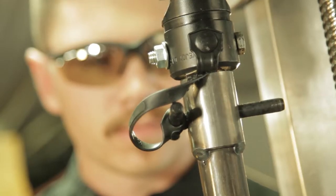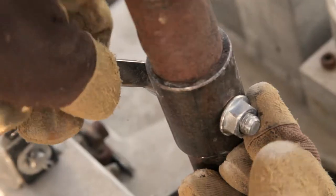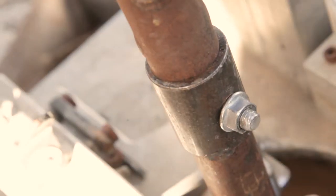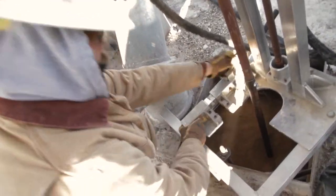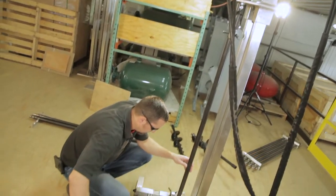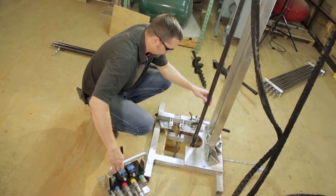When you've confirmed that the cross pin at the top of the new drill section and the cross bolt at the bottom are secure, you can release the drill section clamp and swing it out of the way. Using the hydraulic controls as before, begin rotating the drill assembly and lower the next section into the bin.